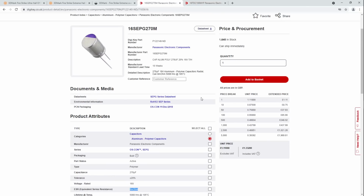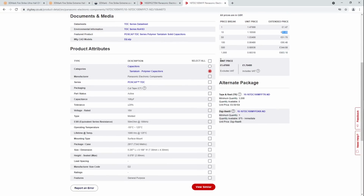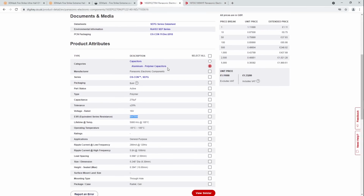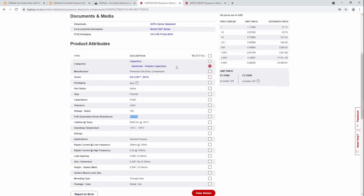And my theory, because the coil whine happens at the frequency of the frame rate, is that I really think the tantalums have a high frequency impedance advantage, which you can't see from the ESR, and it mostly kicks in once you start approaching the megahertz range rather than 100 kilohertz. But I don't really think the problem here is filtering out things that happen at 100 kilohertz, because you're rendering 200 frames a second, which is 200 hertz, right? So I'm not too concerned about the super high frequency performance.